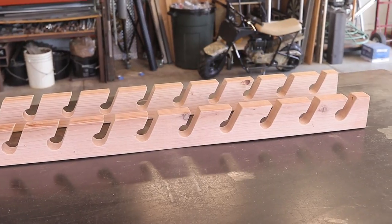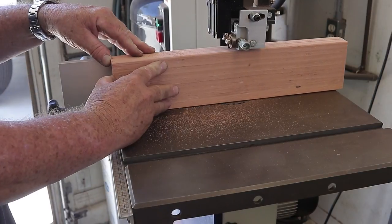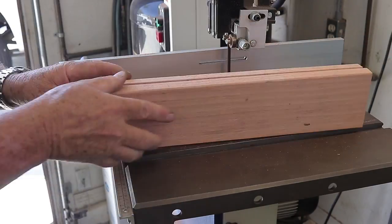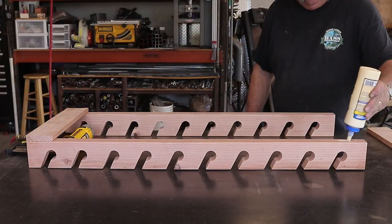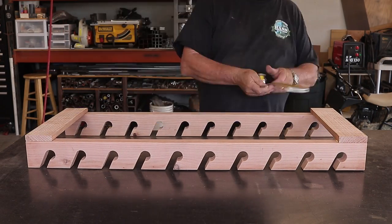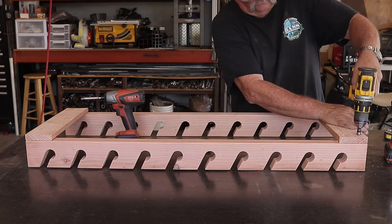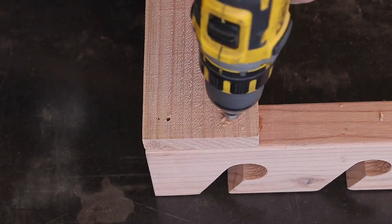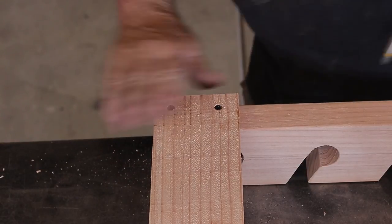This is where I changed my mind — I just couldn't deal with the plywood. I found a piece of redwood two by four in my scrap bin, cut it in half, and now I've got matching redwood. I'm glad I did that; it's going to look a lot better. I used some glue and pin nails to square everything up, then drilled pilot holes with a countersink and ran drywall screws in. This thing is not going anywhere — the screws are nicely recessed below the surface, nice and flush to the back side.